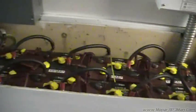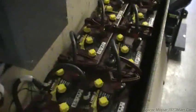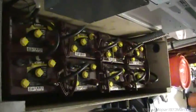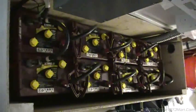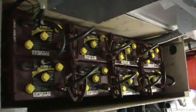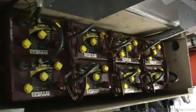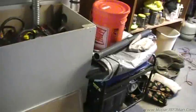There's the battery bank — 820 amp hours of lead acid batteries. That's a thousand pounds of lead acid batteries here. We've got enough power at full tilt for about 5 hours, or 24 hours on a light duty day without a generator. That's no outside power.